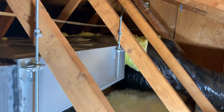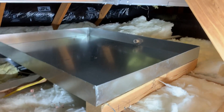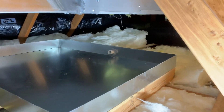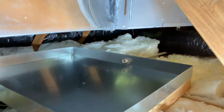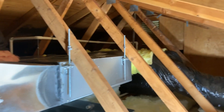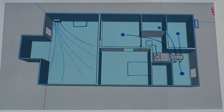These guys did a really nice job — everything looks great even up in the attic. There's our drain pan up on risers to get the slope we need out of the building. The drain pan is overhanging the unit three inches on each side, so we're good to go. That's what a ducted ductless looks like installed up in an attic.